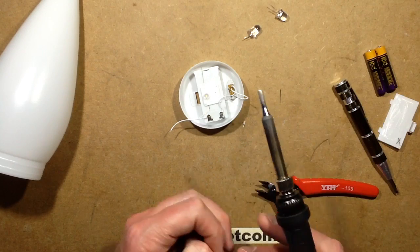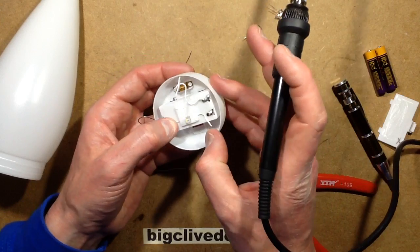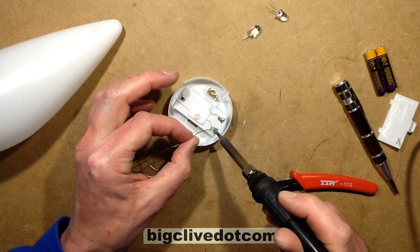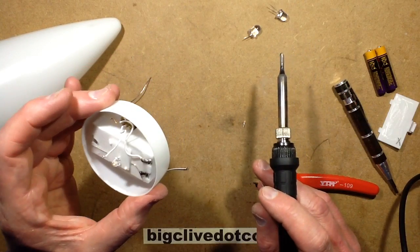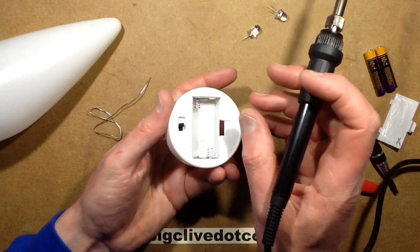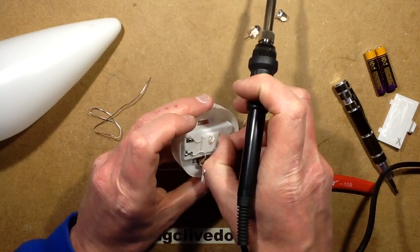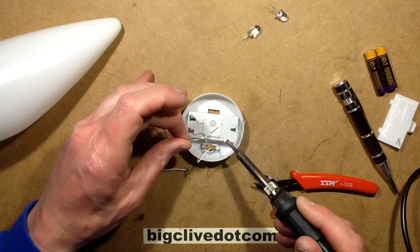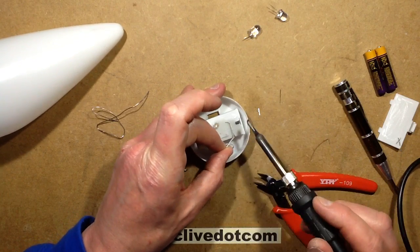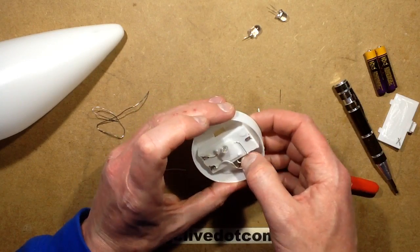I'll actually remove this wire - very sizzly, that's the super extra corrosive flux they use for lead-free solder - and I'll solder that lead directly on with lead-based solder. That's that connection made. All I need to do now is keep this tab at the other side, which holds the commoning tab between the two batteries, so I want to stay away from that. I'll bend it right round and go over to the other side, flow some solder onto there, reflow this and tack that on there. Theoretically that should be ready just to stick the batteries in and operate.